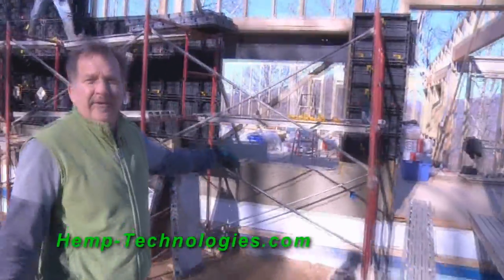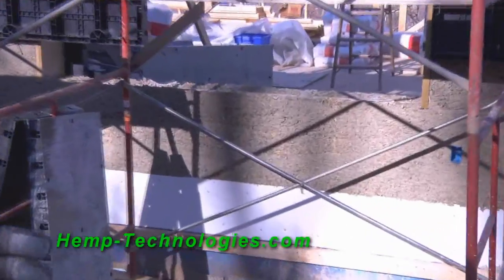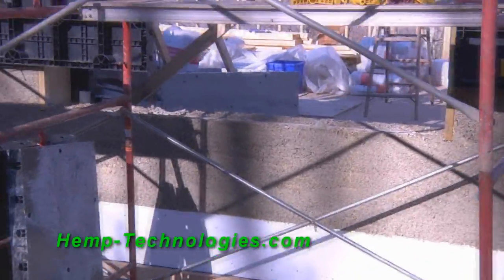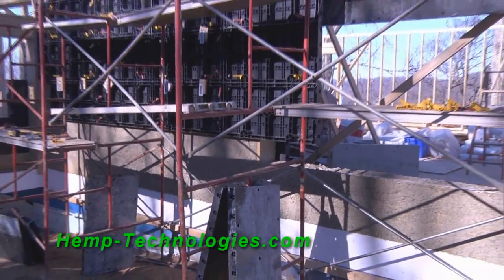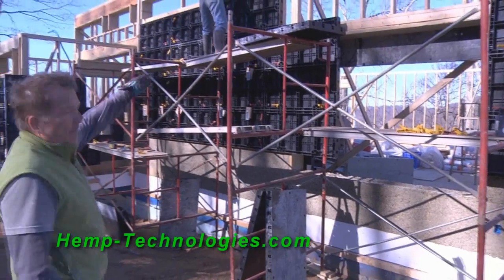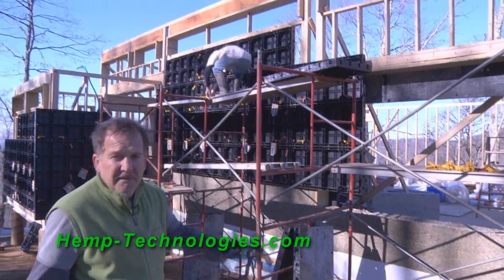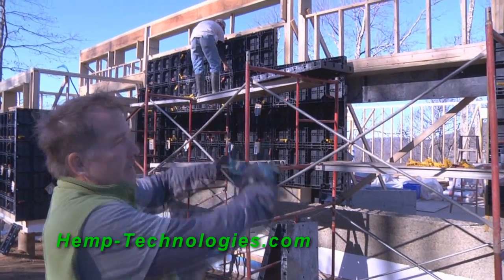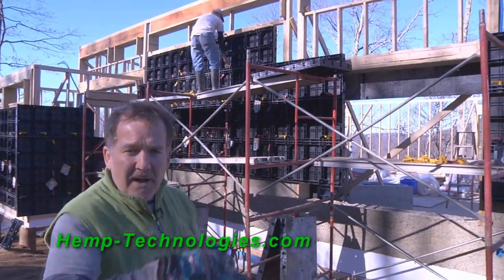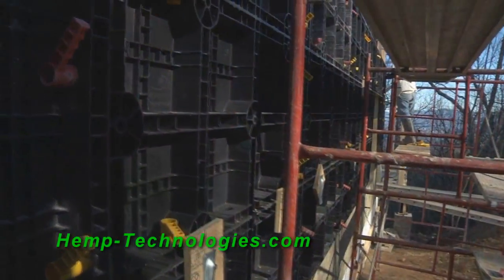Now this bottom layer, we need to leave that shuttering on for 24 hours. And after 24 hours, we can remove that first layer of shuttering system. And then we take the bottom shutters and we move them up on top. Now, in the perfect world, we'd have enough shutters to do both sides. But right now, we have to keep reusing them to go around the house.